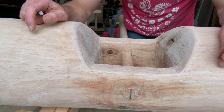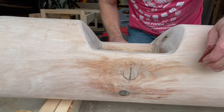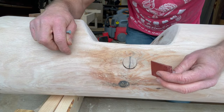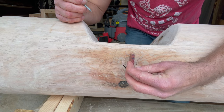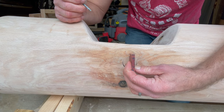You can see my one and a quarter inch oak dowel handle already in place. You can see this line here — this is where I'll make a relief cut back along the dowel, and we'll pound in this red heartwood wedge, so that'll be a nice decorative element. You don't have to do that — you could use oak — but I wanted that.